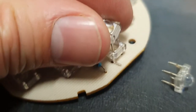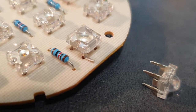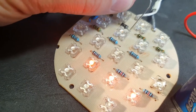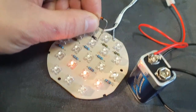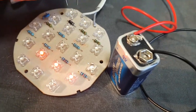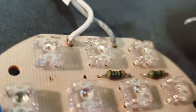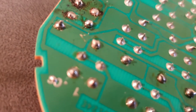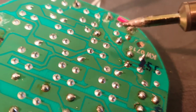You can buy replacement LEDs for just a few pennies. I couldn't find a red one so I used a multi-colored one and bent away two of the cathodes so it came out red. The actual problem was quite clear — it was just a failed diode. Get a normal 12-volt, 1-watt diode. You can see how bridging the failed diode with a new one confirms that is the problem. So unsolder the old diode and throw it away — it's obviously failed after a decade of use. Then solder in the new diode, cutting the leads to size, though you've got to be quite delicate with the soldering iron otherwise you might end up melting some of the other contacts and LEDs.